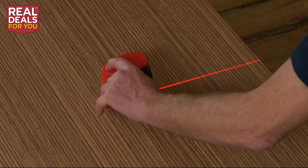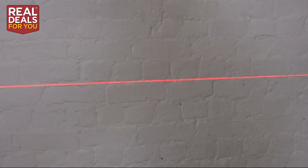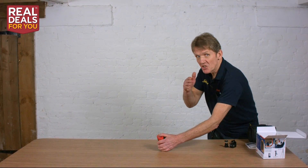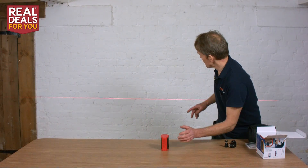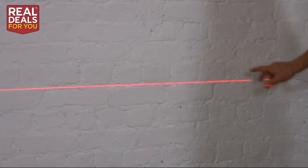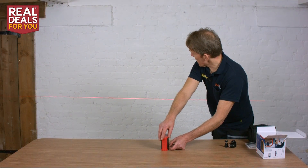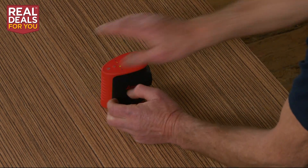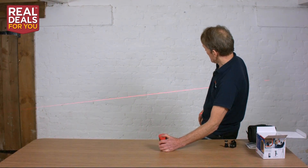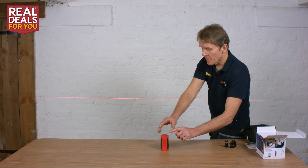In the normal position you would unlock it, and that means it is self-leveling. If I put it into horizontal mode you'll see that horizontal line wobbling slightly — that's because there's a pendulum in there and it's self-leveling. Now when I tilt it, that line disappears altogether because it's no longer level. So once the line is steady, that means it's self-leveled and it's ready for you to mark out your datum around the room. Just make sure when using it that you have it in leveling mode and not the locked position.